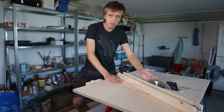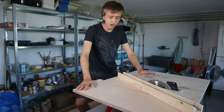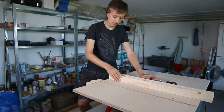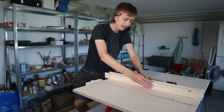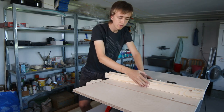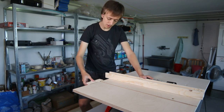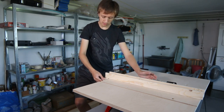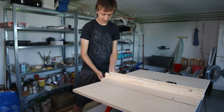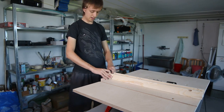While doing that we have to make sure it is perfectly parallel to the blade. As my blade is really nice and square to the edge here, I can also check that with a square and make sure everything is perfect. To start out I am just going to take the fence and press it up against the blade — I raised it up so I have as much surface area to work with as possible — and then loosen this part and slide it underneath, making sure it is nicely centered, and then tighten it so it is locked in place.